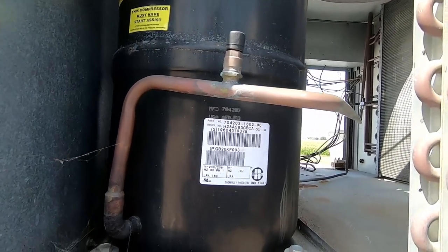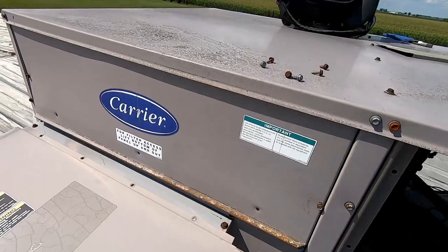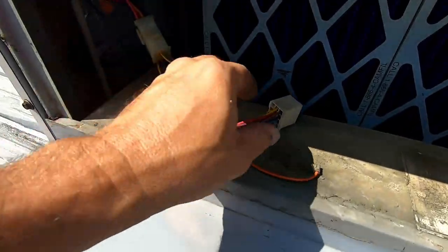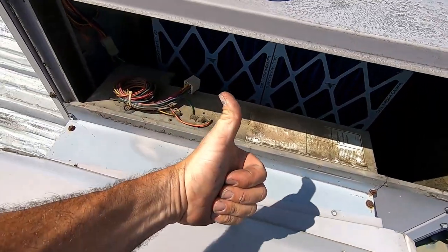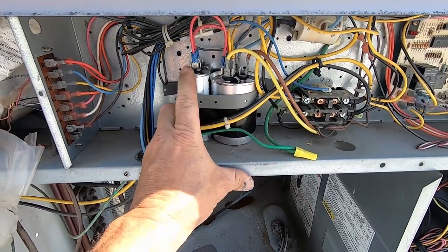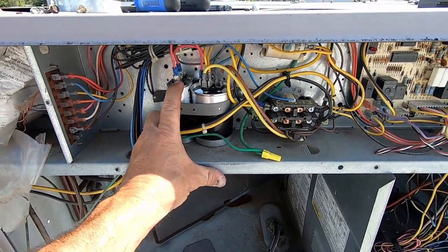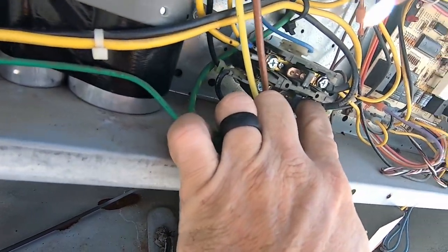It's a Bristol - I don't have an app for them and they're out of business, so that's not happening. Might as well go ahead and give it a look over. Filters look fine, economizer's unhooked, so we're good there. They had to build a capacitor here - got a 45 by 5 and a 15, so that comes out to 60. Contactor actually needs changing too.